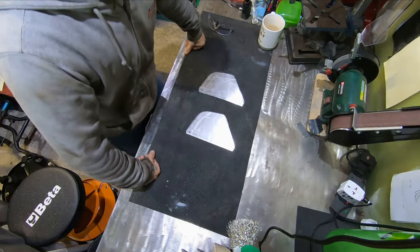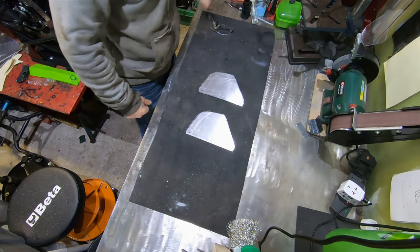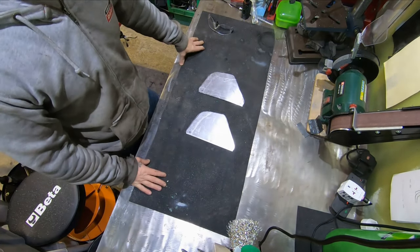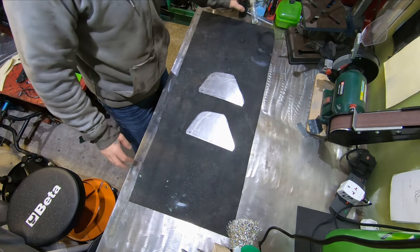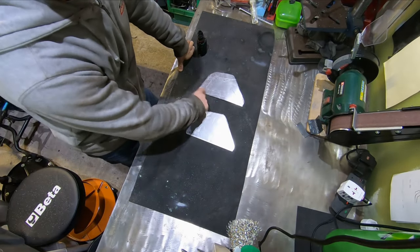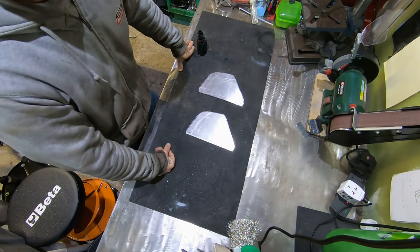Two plates, like I said, not perfect. What we're gonna do now, we'll whack them on the pillar drill. We'll drill these holes out so we can bolt them together and then we can start cleaning them up. I mean, it's not an extensive process. If you haven't got a pillar drill, obviously you can just drill them with a hand drill individually and then bolt them together for the same reason.